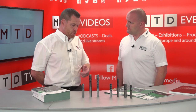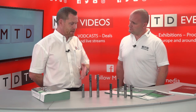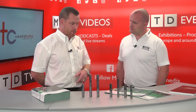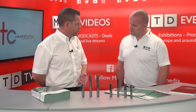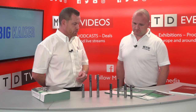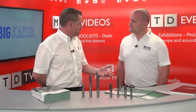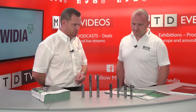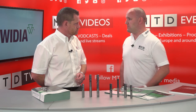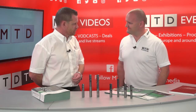Yes, good question. On the range of tools they're producing, there are standard geometries and also dedicated geometries for steel, stainless steels, and going into cast irons. We're doing a lot of titanium geometry tooling now as well, really pushing into the boundaries of aerospace and nickel-based super alloys, which are now coming into play with trochoidal methods. It's a big range and, more importantly, you've got the support from ITC here in the UK. Correct. Thanks Paul. Thank you Joe.